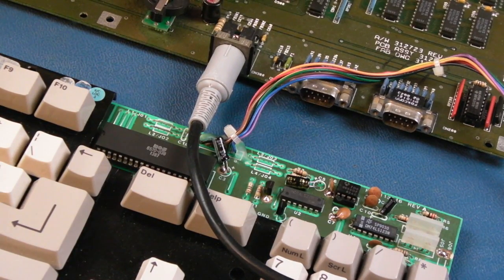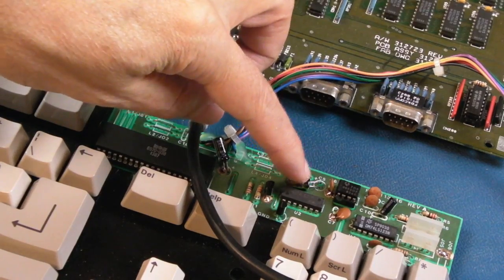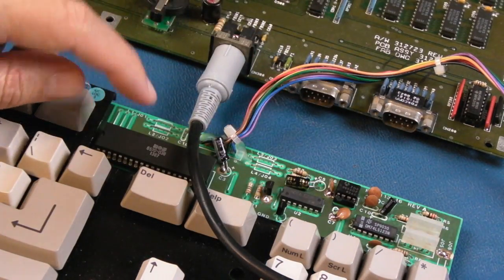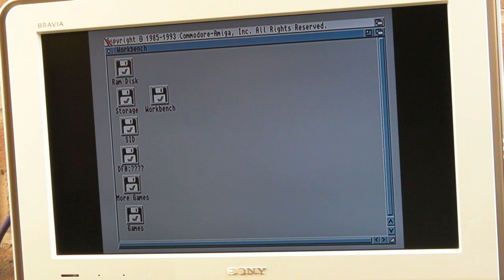So yeah, and that's the thing, capacitors, most of these, apart from one for the reset here, which is that one, probably the small one, these are the ones on the main supply rails. So just by virtue of damaging a supply rail by trying to recap something, you can create secondary faults. I mean, he could have been unlucky, that could have died as a result of that. One of these could have died as a result of not having a ground. So this is the thing, people go, oh, recap, protecting this thing moving forward. Yes and no. Yes, in the sense that the capacitors won't be the thing that kills your system over time, maybe if you've recapped it, but just by virtue of creating a problem while you recap it, you end up killing it. So we are testing on the A2000 here.